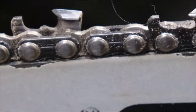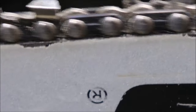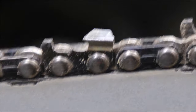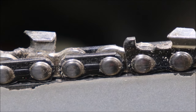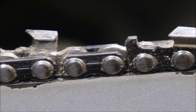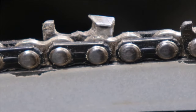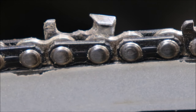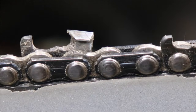Okay guys, there's what it's still looking like after cutting. Still good and sharp, still pulling a good chip. Those rakers - or the drags, as we call them here - are very, very passive. I don't even know that it's the 25 thou everybody runs. I've just always used that gauge. When I get into wanting saws to cut faster and more grabby on the bigger saws, or in softer or smaller wood, I'll take a couple extra swipes or get one of the progressive gauges out. That's what we might do in the next video - just leave it as is and take a little bit off the drags and see what it does. That cutter is still, my gosh, still sharp like a razor.